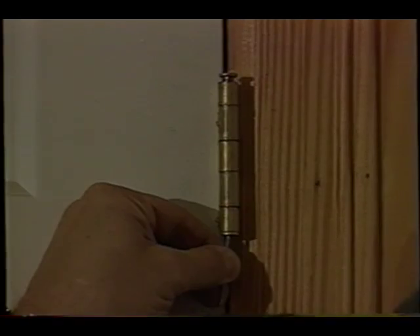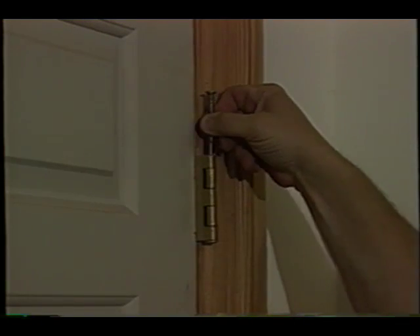What about a door that magically closes on its own? You can solve that easily. Just take the hinge pin out, strike it with a hammer, put a little bend in it, and drive the hinge pin back into the hinge — and you're done. If that doesn't solve the problem, do it to all three hinge pins. That will give enough resistance to keep the door open.